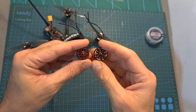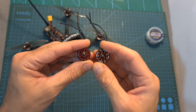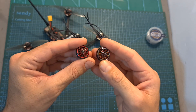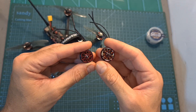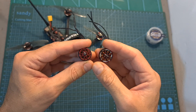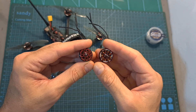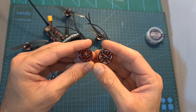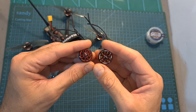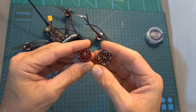As you're about to see in the thrust test — results are included down below — the 1603 motor is more efficient than the 1404 motor. I tested it using four-inch propellers, which are probably ideal for a long-range build, and I tested both motors using different voltage settings, so the results will give you a lot of information.